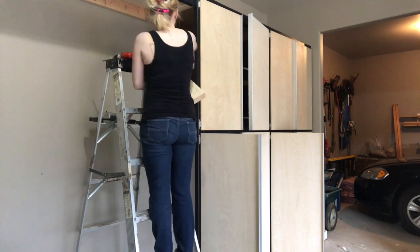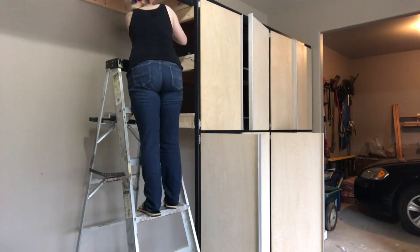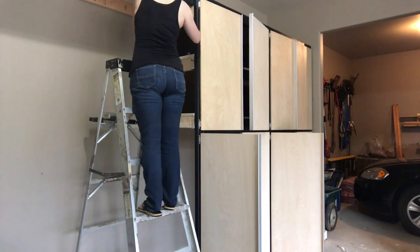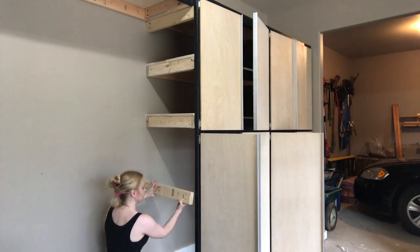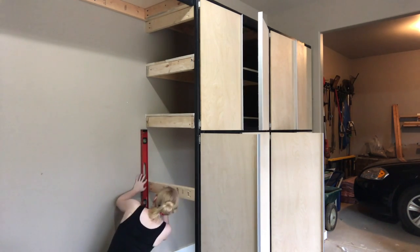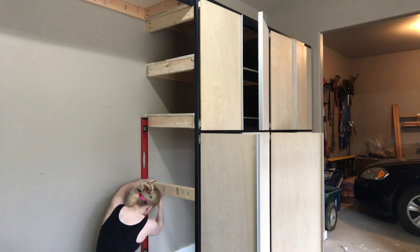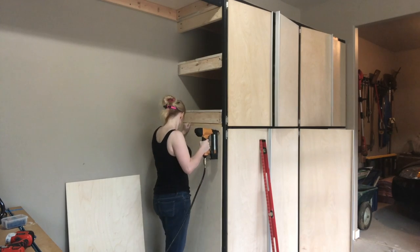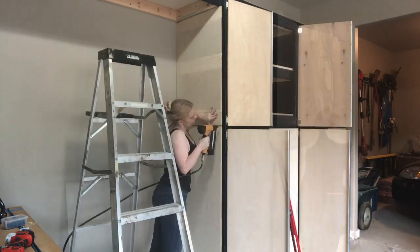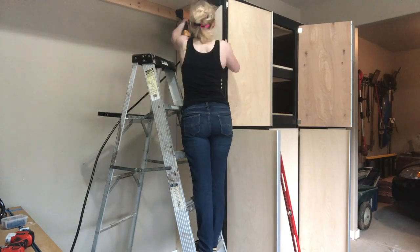When I got around to adding the side panels, I realized I needed some more supports, like the way I built them in part one of the video. So I cut out a couple more, used my pocket hole jig to put some more holes in there, and attached them where I needed more support. I wasn't concerned about the pocket holes facing the outside on this portion because they're going to be covered up with the panels anyway. Then I attached the side panels with my nail gun. You can do a full length on this side if you want it completely streamlined, or cut it to match the length of your doors the way I did.